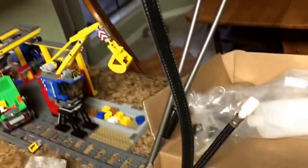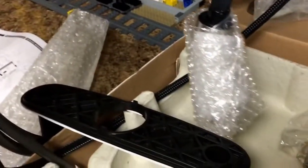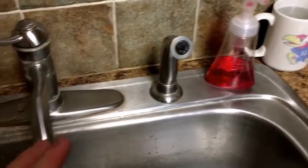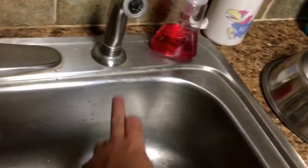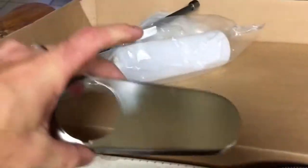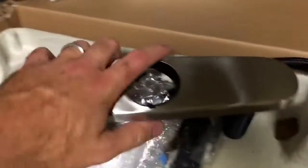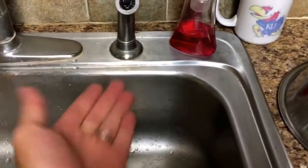So we've got the new one. It's some sort of fancy Delta but it's a big gooseneck version. So it's gonna stick way up out of the top of the sink and then it has the sprayer here that actually spins out of the nozzle. So we're excited to have a little bit nicer, newer one. It's designed to be a single mount like this one, but there's actually three holes in the sink — four if you count this one. So we've got an adapter plate to fill the three holes and then there's a nice little piece of chrome finish that makes it go to one hole. It also comes with this little soap dispenser, which will go here and take the place of the old spray nozzle.